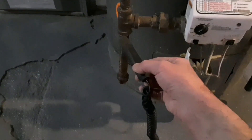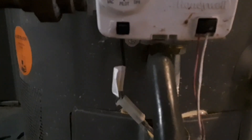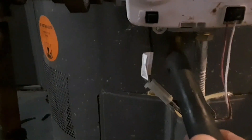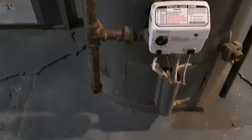As you can see, I go through some of these fittings. That's the pilot supply line, and the one over here is for the burner — no leaks there. That little brass fitting just needs to be tightened up. You should probably disassemble it, put some pipe dope on it, and then tighten it back up.